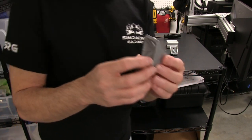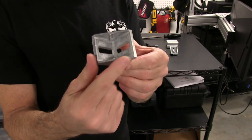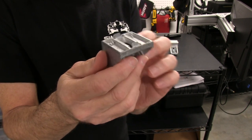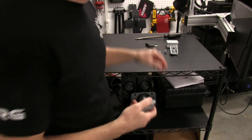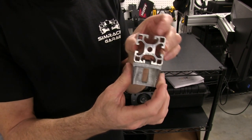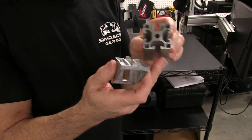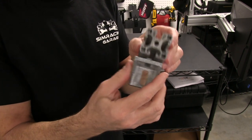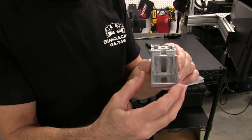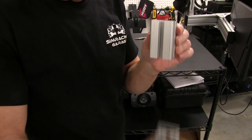Probably one of the most important parts are our corner brackets. These are very nice, heavy-duty, galvanized, and gusseted — meaning they have that extra metal in there for a lot of strength. They also have the anti-twist tab feature — you can see the tabs sticking up, with a set on each side. We use those to keep the profile from rotating on the bracket. There is a little bit of wiggle room, but it's better than having just a flat bracket that can spin around at will.